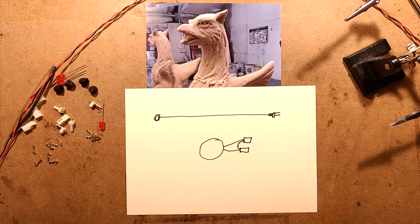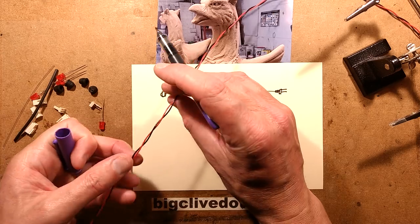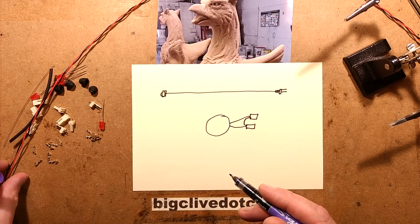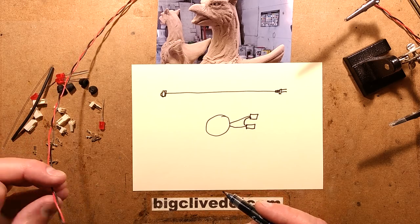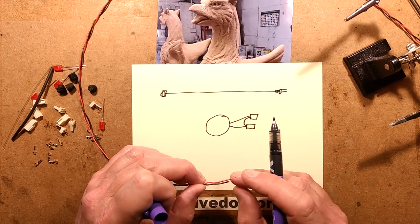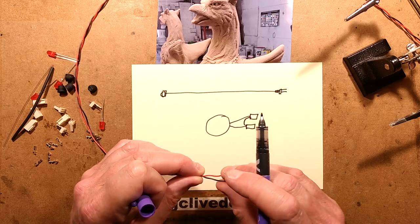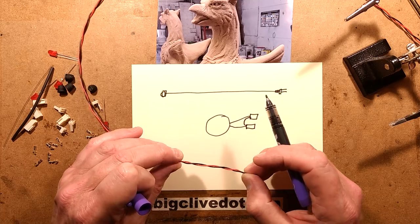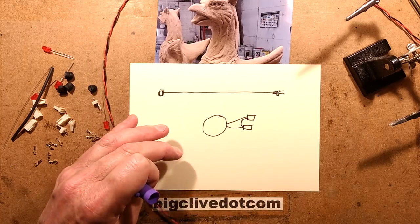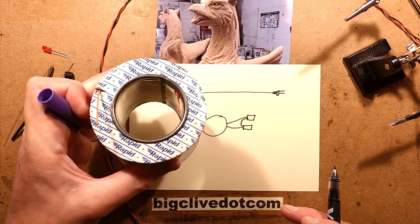The wire is standard red and black instrument or equipment wiring cable with seven strands and a total cross-section of about 0.2mm². It's 1.2mm in diameter, rated for 2 amps, and the insulation is rated at 1kV — that's probably its test voltage. It's about £6 for a 100m drum, which lasts a very long time. Standard equipment wire, stranded.